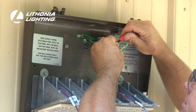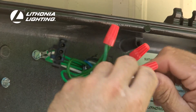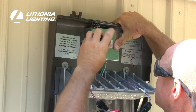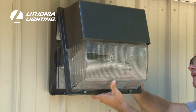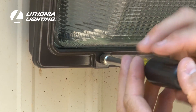With the housing safely secured, begin connecting the electrical wiring leading from the junction box to the Luminaire. When the connections have been made, reinstall the electrical splice compartment. Be sure no wires are pinched when the compartment is reinstalled. Finally, reattach the front housing, make the remaining connections and tighten the two captive screws on the front cover of the Luminaire.